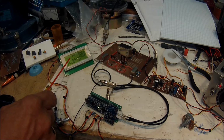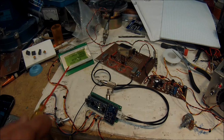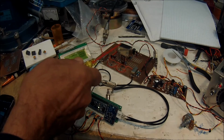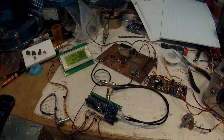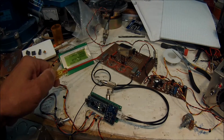This is the display. I have the default set up right now, so when it powers up for 40 meters, it's operating on lower sideband, even though this will say 8.99850 with a 9 megahertz crystal filter here. It's because I'm placing the LO above it and you get a sideband inversion. Little volume control, little audio amplifier here, basically dumping the antenna without any kind of front end into an SBL1